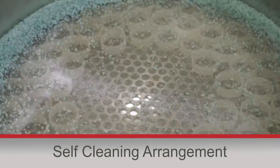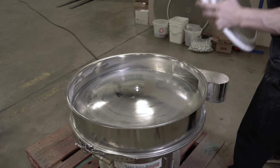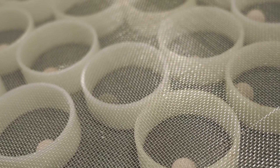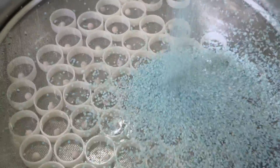Our next solution is a self-cleaning arrangement and is very similar to the clean ring assembly. Self-cleaning consists of two mesh screens with plastic rings in between them, and small balls inside the rings that bounce around to help dislodge near-sized particles.